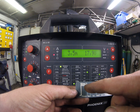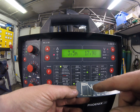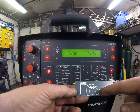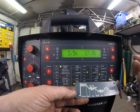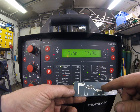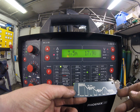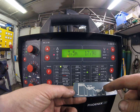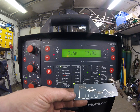We've got an adjustable slope-down time from hot start current to main welding current, and we can adjust the time frame for it to slope down to a base current if we're using a pulse, super pulse, or double pulse. There's also the ramp-up time back to main welding current, and at the end, if we're using a crater fill, we've got the option to select the time frame to slope down to our crater fill current and how long it spends there.